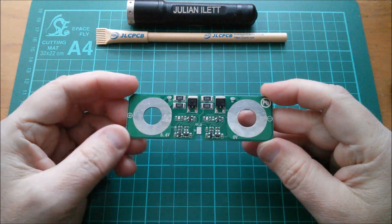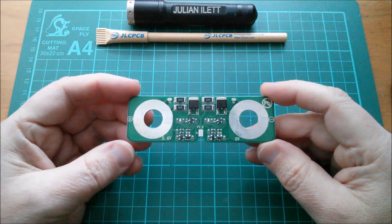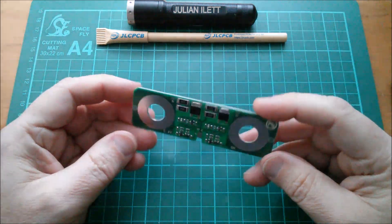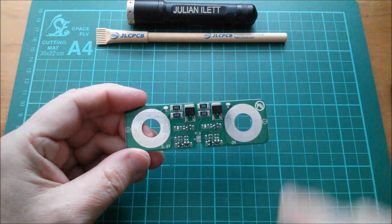There are some slightly different board versions with chamfered-off ends, but again they're designated for 3000 farad capacitors. That's rather expensive if they only send you one. Even for two it's not cheap — I'm not quite sure what I'm going to do with 3000 farad capacitors just yet. Even buying two would get close to a hundred dollars and that'll only give me 5.4 volts.